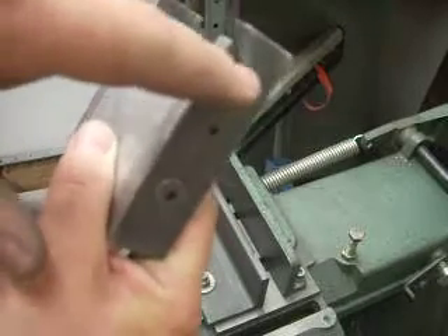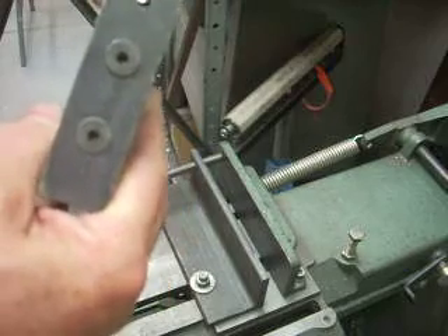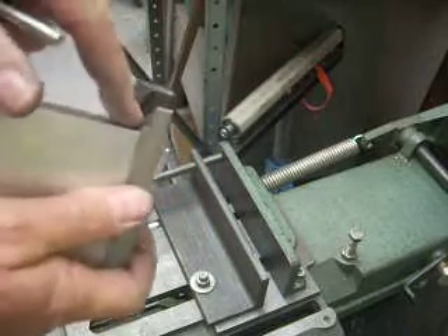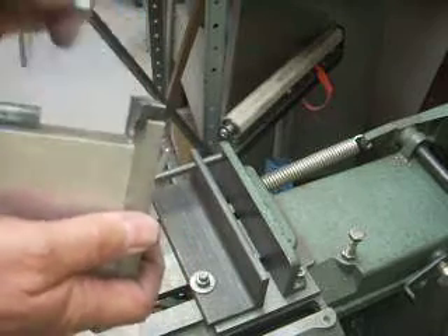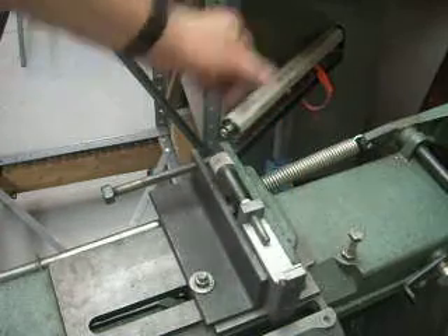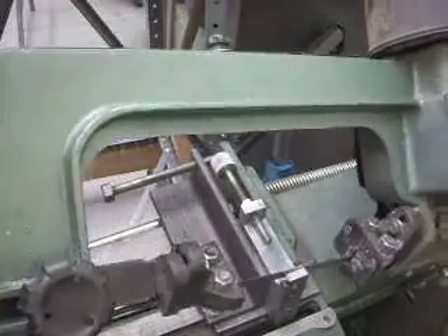If you look down this slot at the bottom, it's threaded quarter-20, but the gap is wide enough that there's a nice easy fit. On the back side you can see there's a cut in here where the saw goes. And on the left side of that saw cut, it's been cut out, and that gives me a place for the scrap part to fall out and be pushed out. So what I do is drop it in the jaws of my bandsaw, and without the saw running, I slide the blade down and lock it in — lock in the fixture.